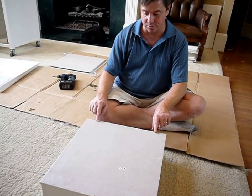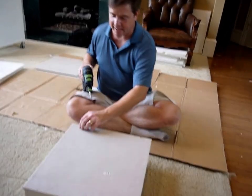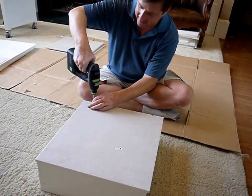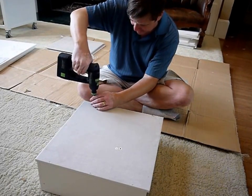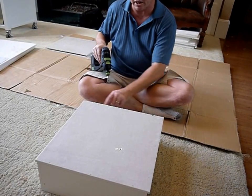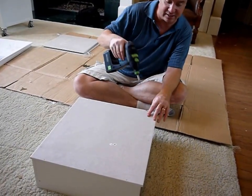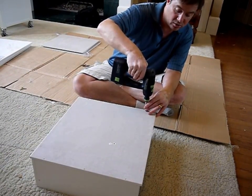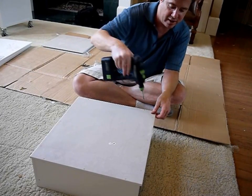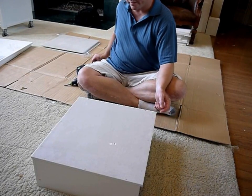I've lined up two of the screws directly into the holes, making sure they get a little bit finger tight. And you get your trusty screwdriver out, whether you're twisting by hand or not, and screw it in. You will know when to stop because you will feel the pressure, but it countersinks down in there, just like it did on the side holes. Those are counterset holes to make the screws below the surface so it will not affect your gliding. You do not over-tighten because you're going into a thin piece of wood.